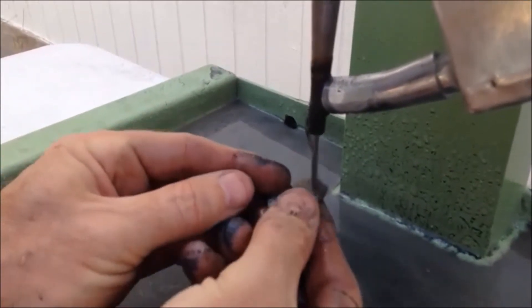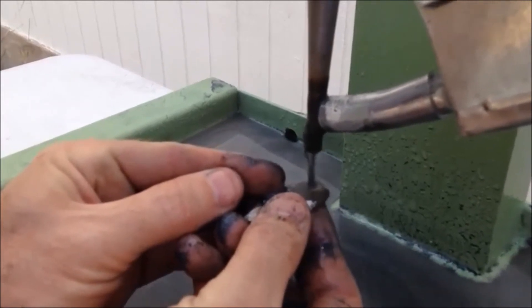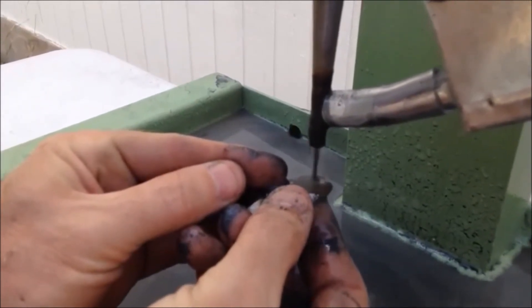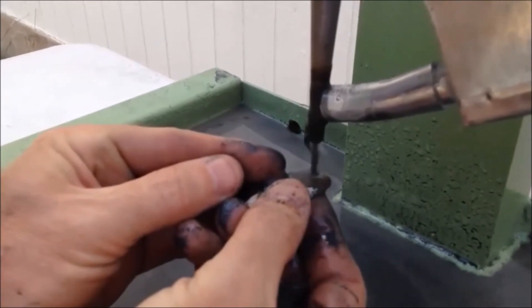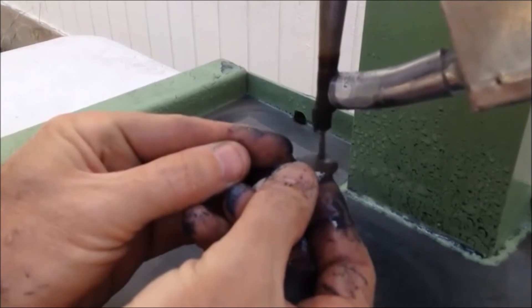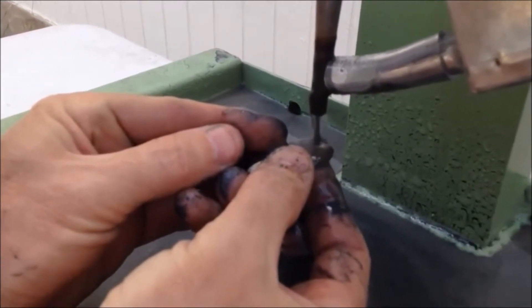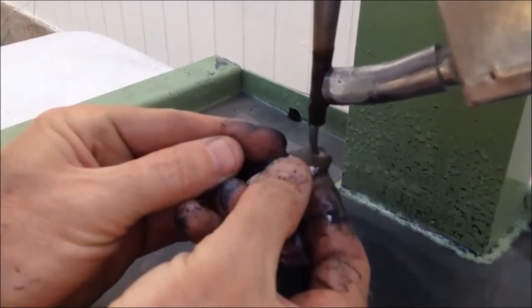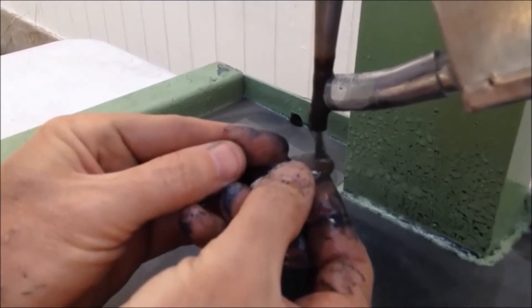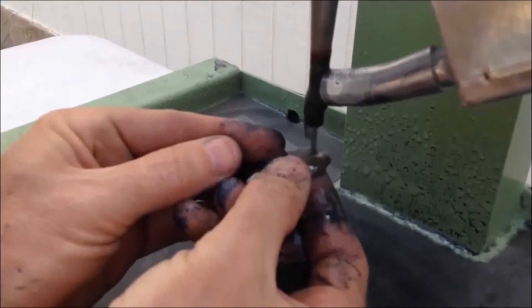So I'll go through and drill a few more hard jaspers and agates, just samples, and you can kind of see the grit flow. You can see that the inverted cone shape which indicates a real nice harmonic vibration. And like I said we're running about 60% power. You can crank the power up if you are running a bigger diameter wire, but generally it's pretty good — it drills pretty fast at this size.